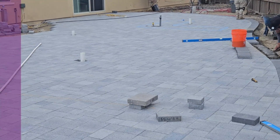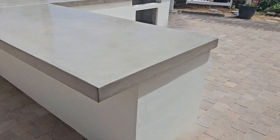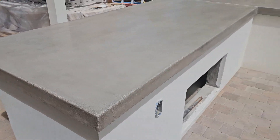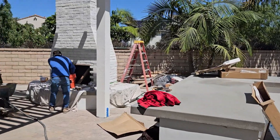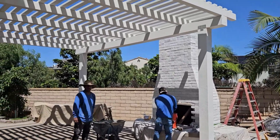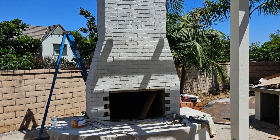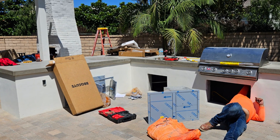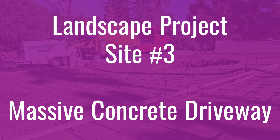Number two: an outdoor chimney and outdoor kitchen. The kitchen is all done — they polished the concrete top and did a beautiful job. It's a nice poured-in-place concrete top with a top cast finish that has extra texture. This week they're installing all the cabinets, the grill, and the drawers. Meanwhile, two other guys are working on the chimney facade, which matches the inside kitchen facade to give a seamless flow from outside to inside.